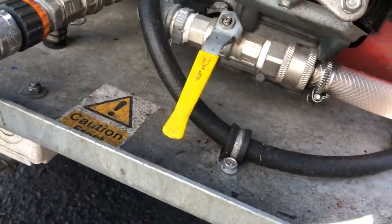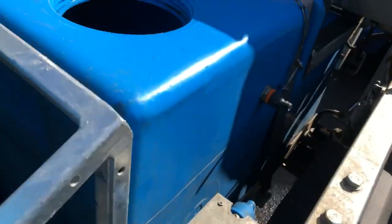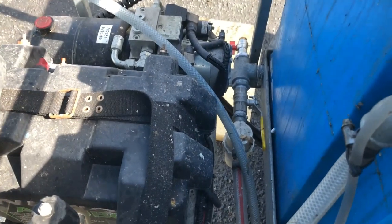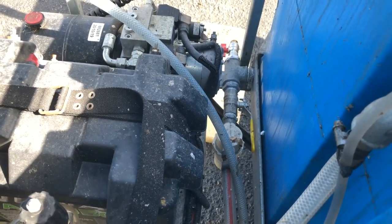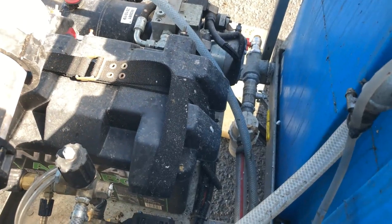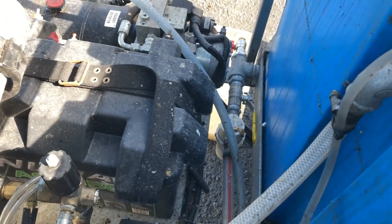So frost protection — that will be the end of the day for frost and it's protected. We're not going to go to all this trouble like we are now; we're probably going to put antifreeze in in frosty weather. It's such a small little filter and that's all there is to protect that pump from any dirt when it does start to get clogged. You have all that dirt in there getting into there — it's going to be checked on a regular basis. It's such a crappy idea that you'll end up getting air leaks then next thing.